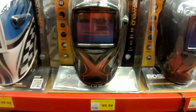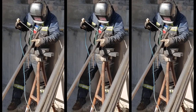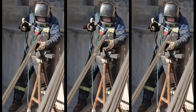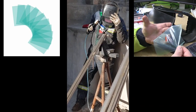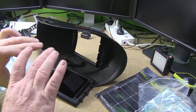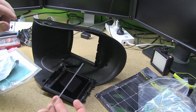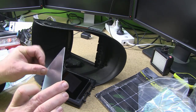Grab your helmet and put it on — can you see through it? The amount of times I've seen mates trying to weld in a helmet that's all scratched up, covered in dust, burn splatters — you can't see two inches in front of your face and then wondering why their welds look like shit. Go to the hardware store, get new plastic splatter guards. If that doesn't help, you're up for a new helmet. If you want any chance of welding correctly, you need to be able to see what the hell you're doing. There's a link in the description if you need a hand changing your screens.